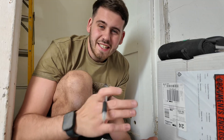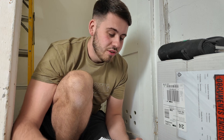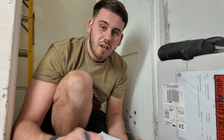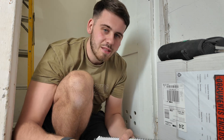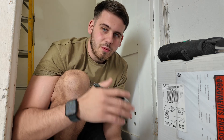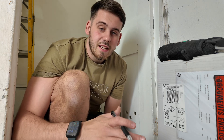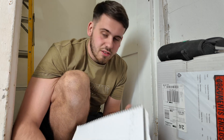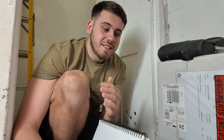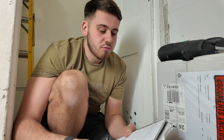We've just had a walk around the property and there's actually not too much wrong with it. You see a lot worse properties. All the accessories look pretty good and in good condition. All the lights look fine - there's only one light hanging down from the ceiling, but we could probably prop that up today. Other than the plastic fuse board underneath the stairs in that cupboard, I think that's going to have to change and we'll need to put some RCD protection on it. The intake looks pretty good - they've got earth bonding on the water, so that's all covered.